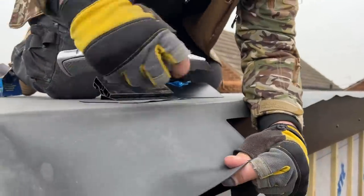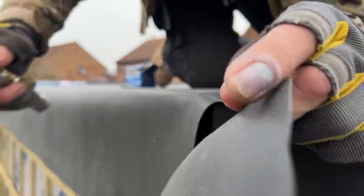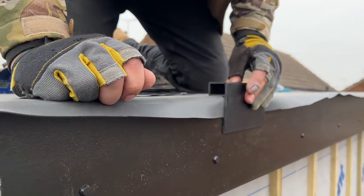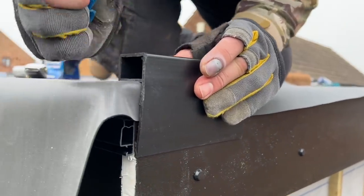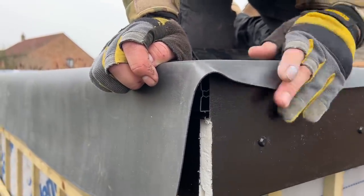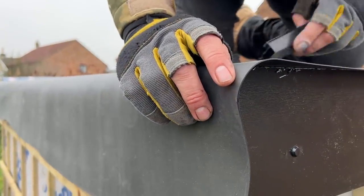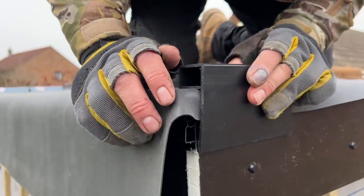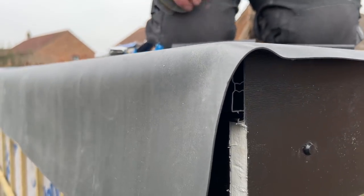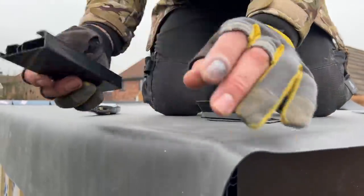What you want to do is just pull it away from the roof — you can still see the line there. I think the manufacturers say 50mm. I'm going to go a bit less than that based on experience. You can cut yourself off a little bit of P trim, put it on, and that'll sit all the way down like that which is lovely. Before I forget — you also want to go around and get your fascia corners on before you start fitting this. Get the fascia corner on, get it tucked up to there, and then when this P trim goes on there it'll conceal that cut on that corner trim. Then there's a corner that goes on there but I'll show you all that.